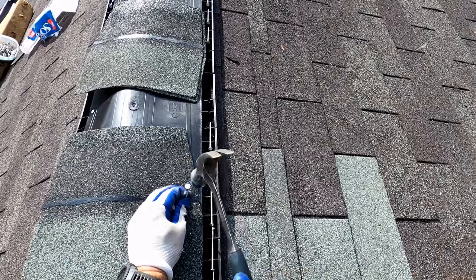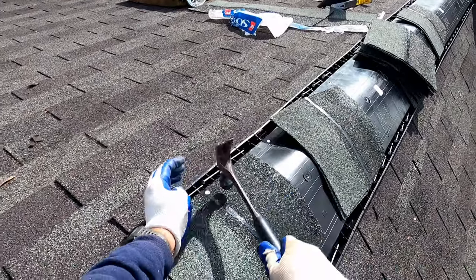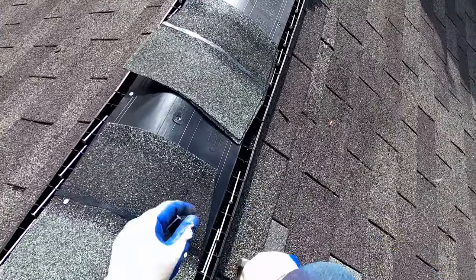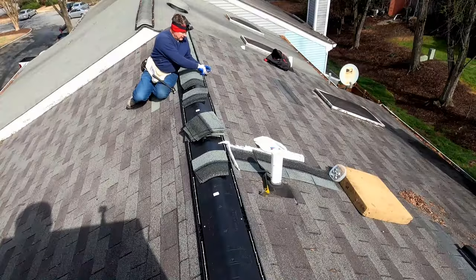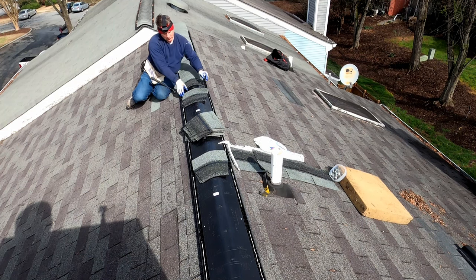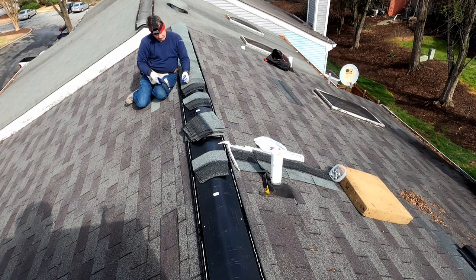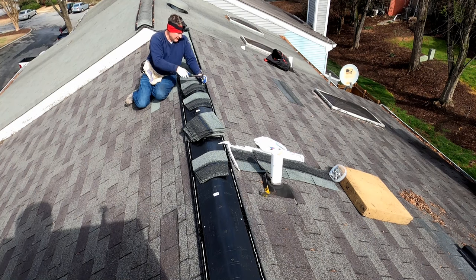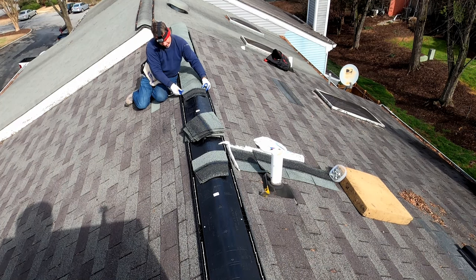I would say probably 80% of the houses that have been built in the last 15 years or so that I've been around have had this kind of ventilation, where it used to be a lot more random. Had what's called turtleback vents, power ventilators, turbines, whirlybirds, all kinds of options, but these are so good and so cost effective that they've just about taken over. And again, I'm in Georgia, so my only roofing experience comes from Georgia. May be completely different wherever you are.